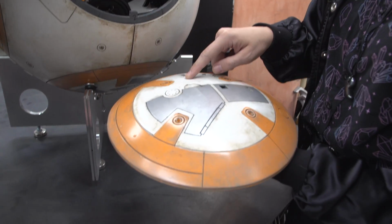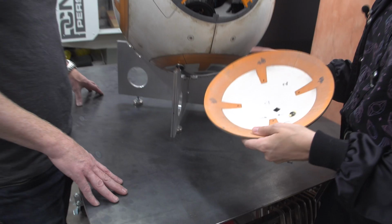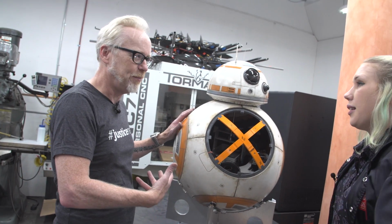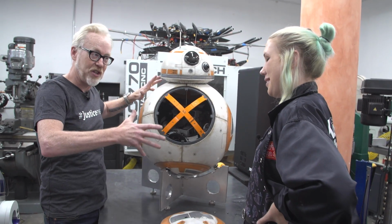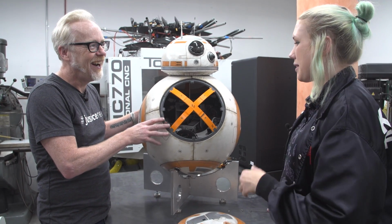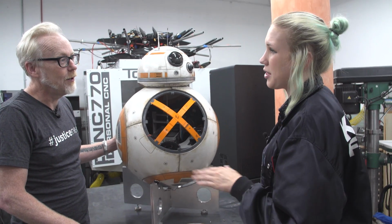The center was one piece, and each of the triangular panels was two pieces. Well, so I think that people often think of 3D printing as like, well, that would make it really easy because you just print the parts and bolt them together. But on a piece this big, radii can warp and they can change, right? Exactly. So we were printing each panel like 2 or 3 panels apart a piece. It was kind of crazy for a while.